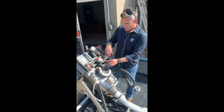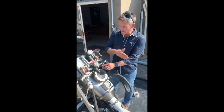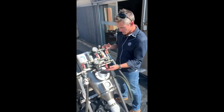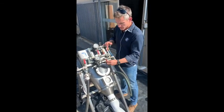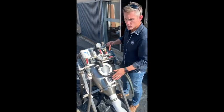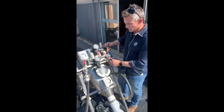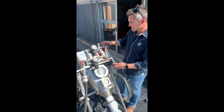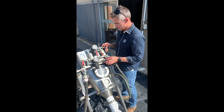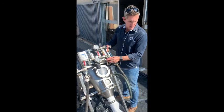This one is for regulating. So when we have fully inverted the whole line, we will stop blowing over there, keep this closed or just breathing and regulating, and open this one and adjust to the correct holding pressure that we want to be holding it. The problem we're having is that we're doing all of this and it's getting stuck and we don't know why.